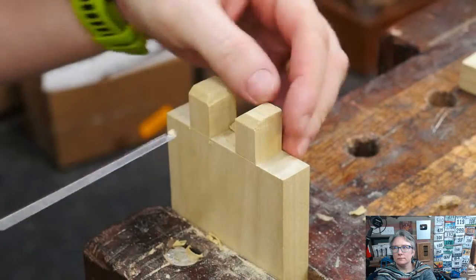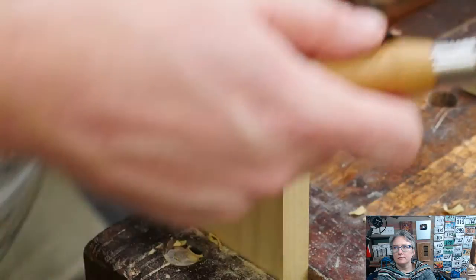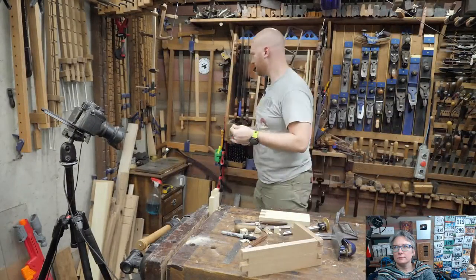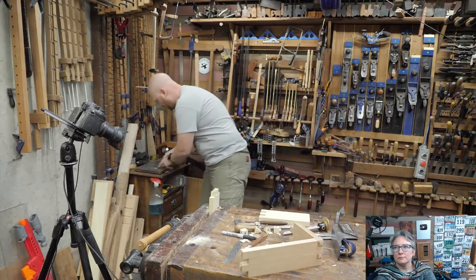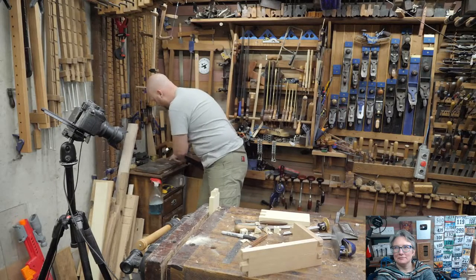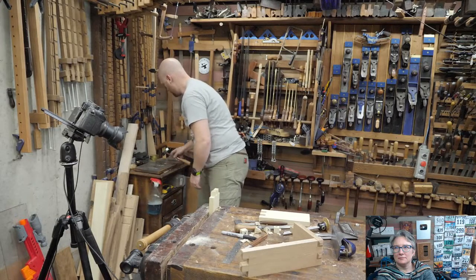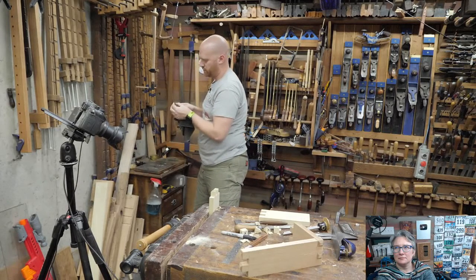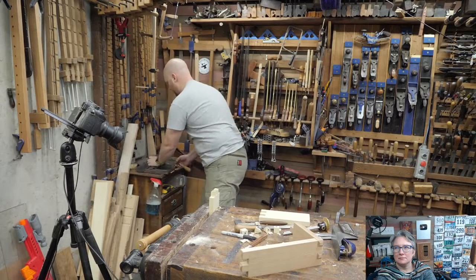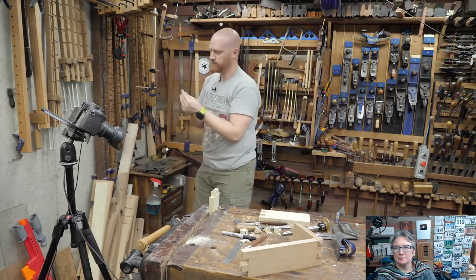You know, this chisel's a little bit on the soft side after that chopping. And I'm also seeing some lines in the cut. So when you see that, it's just giving a little bit of resistance. It's time to sharpen. My diamond stones, a little squirt. Coarse, medium, fine. I could probably just have taken this one to the strop. It's not that bad. Clean that burr, check. Yeah, that's what I'm looking for. And strop it. Yeah, it feels good.